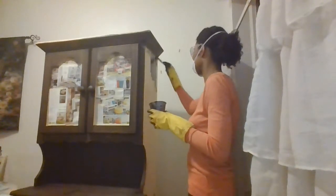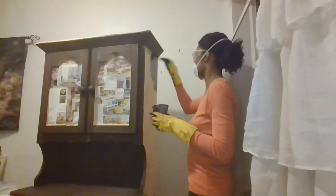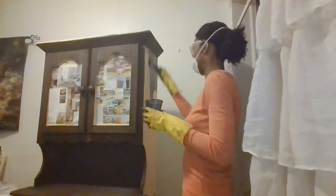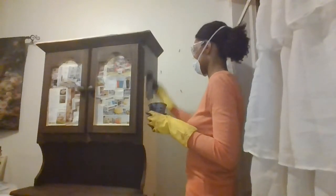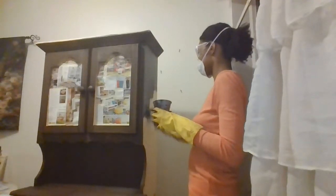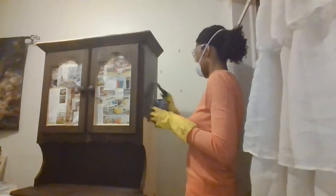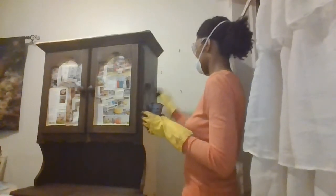As quick as possible, as much coverage as possible, and then wipe it off as quick as possible. Adding the 10% mineral spirits helps this product because it's really thick — it helps the product spread faster and more evenly onto the unfinished surface. You can see how easily it goes on. Now I'm going to wipe it down with everything within arm's reach.